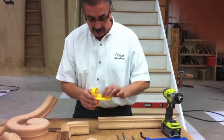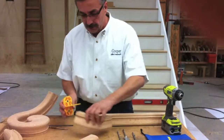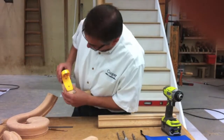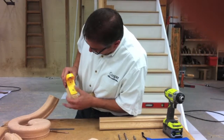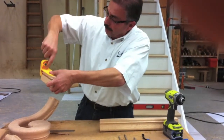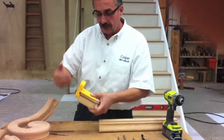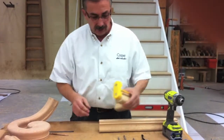Now you take your guide and see these little windows here? The first hole I'm going to drill is going to be the 1/4 inch hole that actually holds the Zipbolt. So I'm going to line this up on it and gently press in. Now you see here, you get some hardened alignment pins, so when you press that in, it holds it into position, because when you're drilling a 3/8 hole, you're going to re-enter that piece. So you get that all set.